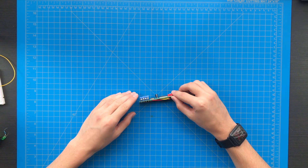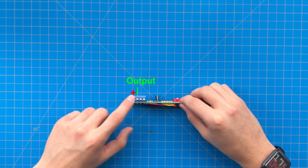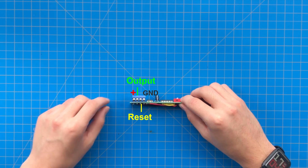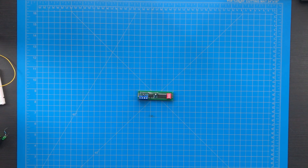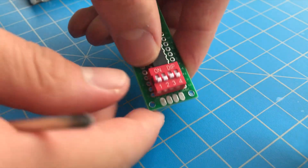There are four pins on this board: positive power, output, reset, and ground. The reset is the input which will reset the value on the counter. The output signal is the signal sent when the watchdog timer is not reset after some time. Through this DIP switch, you can choose that time interval to be lower or higher.